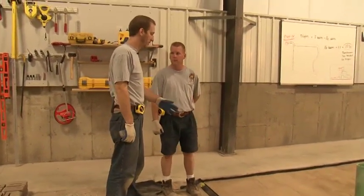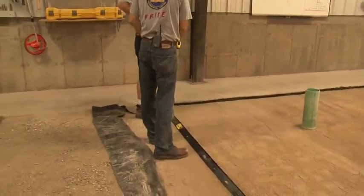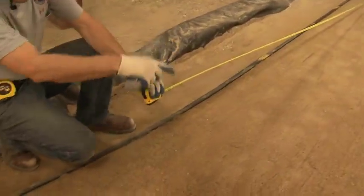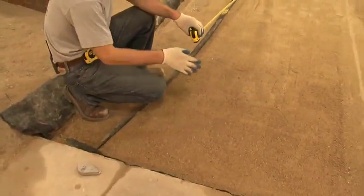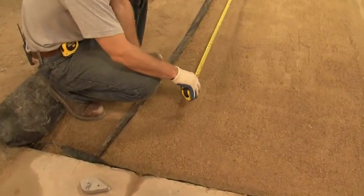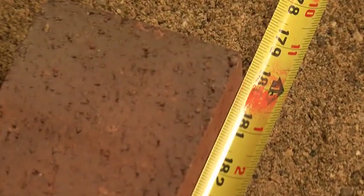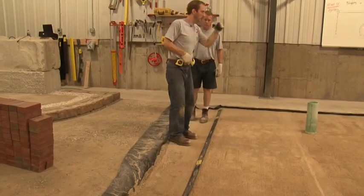Now that we need to snap our parallel reference line, we'll choose a number — 14 feet. You want to hold your tape measure. We're choosing 14 feet because we know the length from our garage slab to street curb is 16 feet. We don't want it right up against our street curb, but close enough to straddle the laying edge and the street curb while laying. The mark is on 15 feet because he's holding the tape measure 12 inches beyond the curb to give us a more accurate measurement. Now let's do the same thing on the other side.